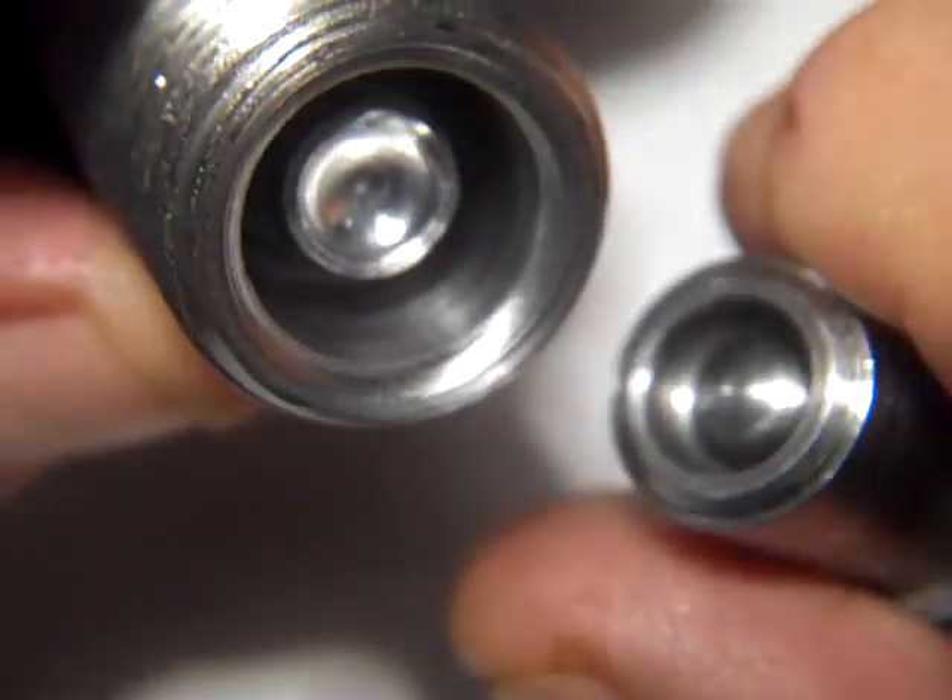When you pinch that up in there and everything is pinched in, and this squeezes together with the press, it swages the bullet to where there's just a little excess. You set it so there's a little excess lead, so it forms real nice and tight up in there and there aren't any gaps or hollows. You want it to bottom out just after you use up all the space — that way it swages perfectly into the space you've allowed. And when you do it just right, there's a little excess lead that squeezes out around the edges, and this lip here cuts it off like an anvil, pinches it off.